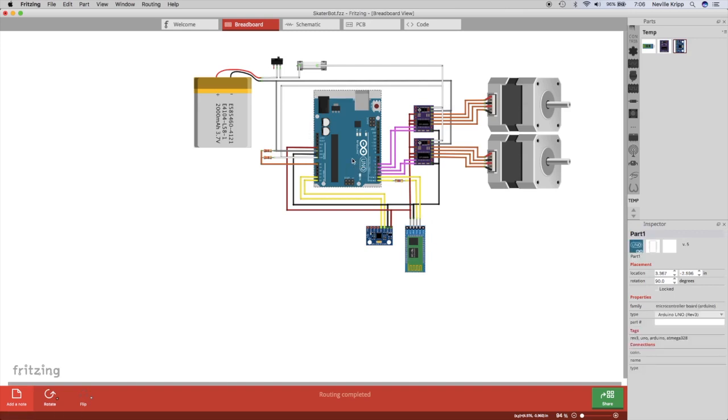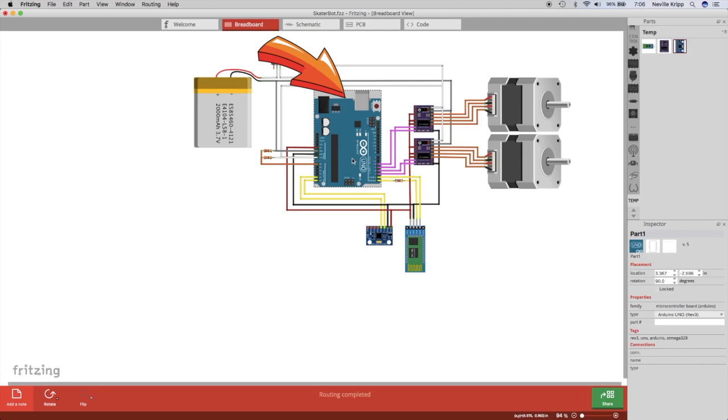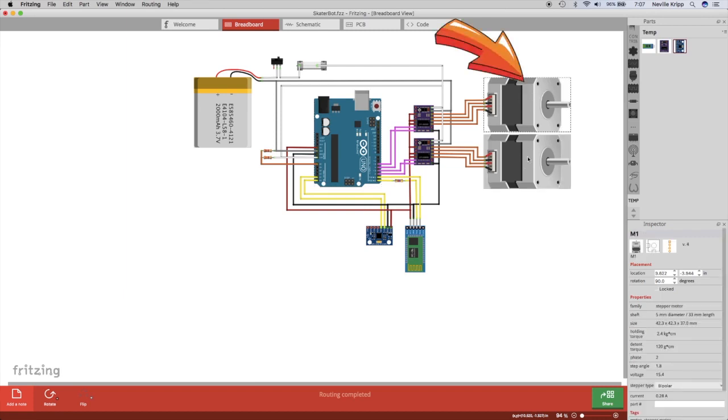The core of this project is the Arduino Uno, selected because it's a single board device that has all the required interfaces on it. The motors are two stepper motors, one left and one right. I'm using stepper motors because they're more repeatable — I used DC motors in an earlier project and tuning the loops was a real pain. I got it to balance but it was terrible, partly due to the quality of motors used in these hobbyist builds unless you spend quite a lot of money.